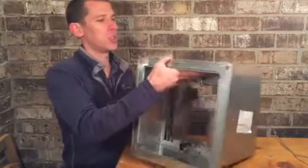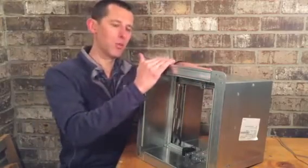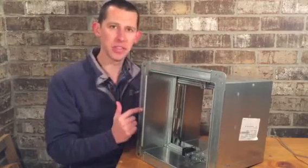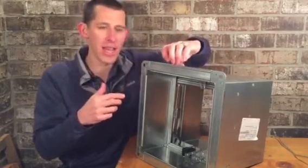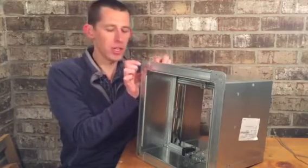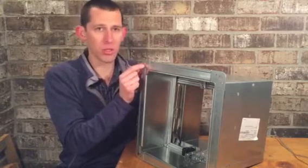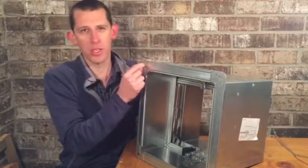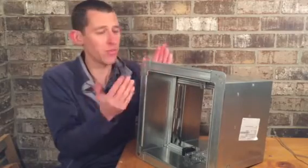All right, some other options that you can get. We have this breakaway flange on the front. So this slides into the wall. Your duct mounts to this right here, and your duct would have a matching piece that looks like this. A lot of times people will use bolts through these corners, and then there's clamps that go and would clamp on these. You can leave the bolts. You can even use the bolts to secure it. The bolts will pull through these holes if you use the right small size bolts as recommended. These corners are designed to tear away, so you don't have to go through the extra labor and expense of pulling those out if you don't want to.